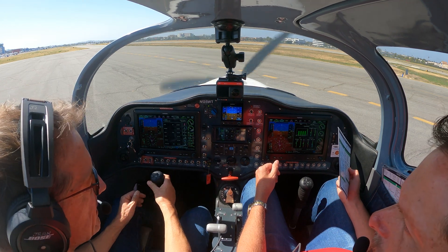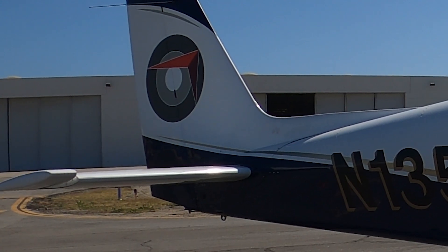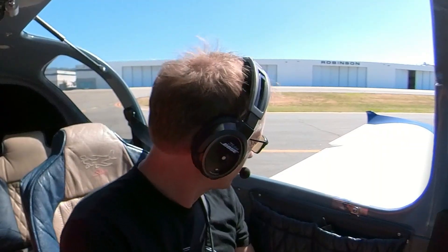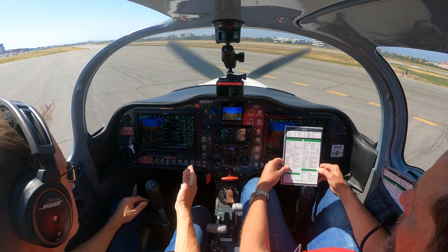Controls — I've checked and done a box check. There's nothing interfering. I think you've checked this in the pre-flight, but you can confirm the elevator is moving, and the ailerons are moving. If you go left, that one's up; go right, that one's up. That's the box check on the controls.